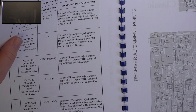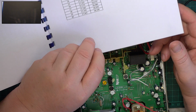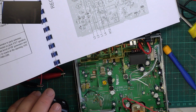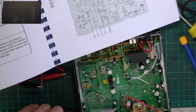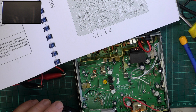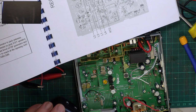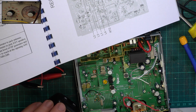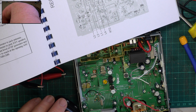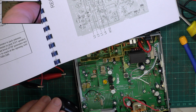So if I put in 27465, 27405, isn't it? So as it stands, what are we doing? What are we getting? The answer is we're getting 0.375 microvolts per 12 decibel SINAD. Let me show you that. There's 12, and there's your attenuator at 1 and 0.375.